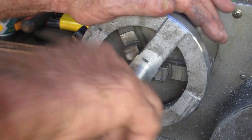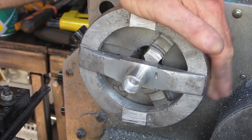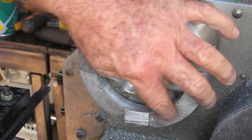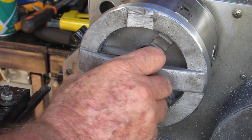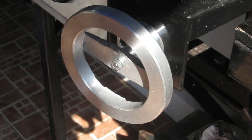I didn't bother filming that - what I've done is bored it out to 12mm and then 15mm which is what the shaft is, and there's a 6mm hole up inside there for the little nut that holds it all together. I've decided I'm not going to do anything more with this just at the moment - I'll wait until the table is fixed and it's all back up and running, then I'll take this back off and run a mill across here and across those flats on either side to clean all that up, because it won't stop it from functioning in the meantime. I've decided I'll machine the micrometer wheel to run on the outside of that - so let's go try it on the shaft. Well there you go - definitely got more leverage on that than before, it's much easier to turn. I could go to the trouble of drilling and tapping and putting a handle on there but I think we might call that done for this video. Thanks for watching and we'll see you again next time, bye bye.